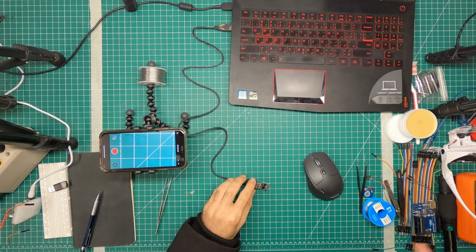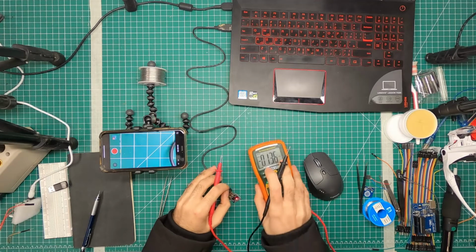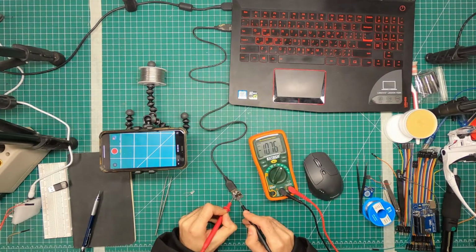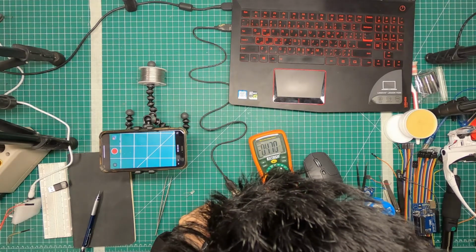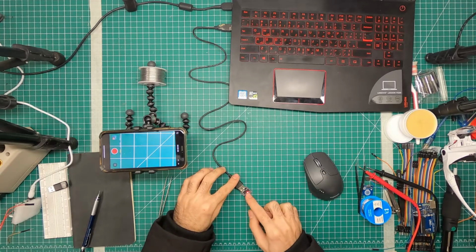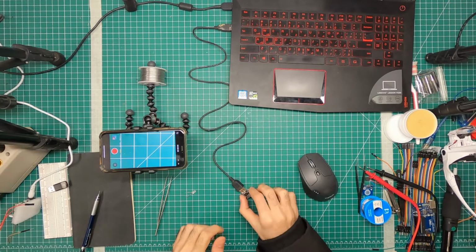And out of these 6, we can find out which one that is by connecting our multimeter. Multimeter is 1 pin to ground, and the other pin, let's try pin 0. So it's not pin 0, it's actually P1. Is it? Yeah, it's P1. It goes to 5 and then 0. 5, 0, 5, 0. So it's P1. Okay. Cool. So P1 on this board is connected to an onboard LED. So you can kind of debug and see if your program checks out. All right, that's step 1.